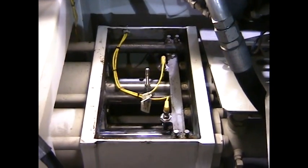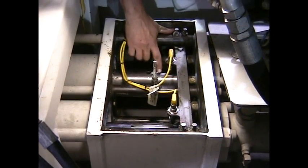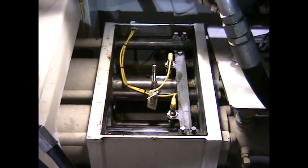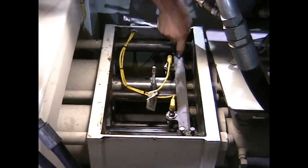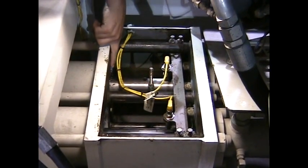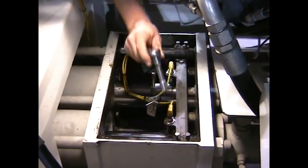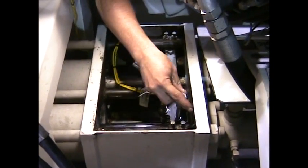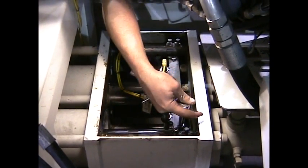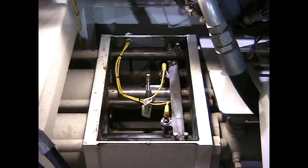We use hydraulic oil here at the factory. We like to fill it just to the top of the coupler. If your machine cycles extremely slow, it's best to fill your oil level to the top of your cylinders — that way your piston cup is always lubricated regardless of how slow it strokes. That's it.